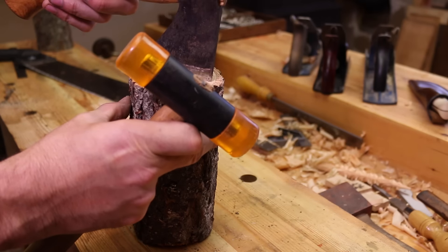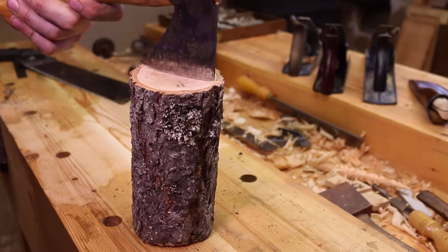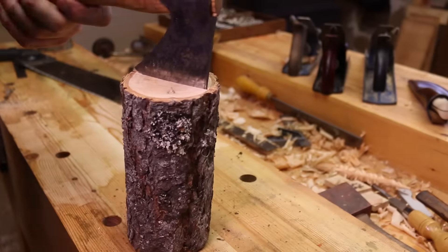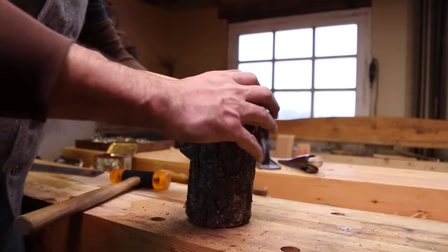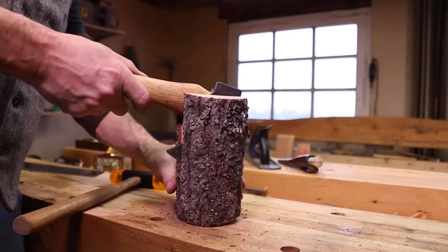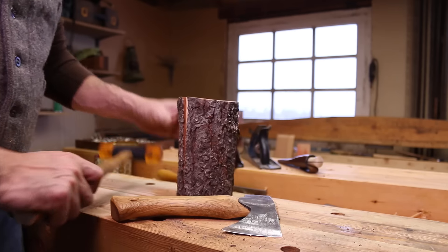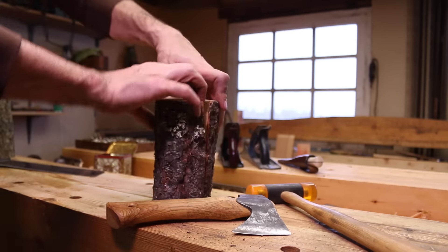I'm not sure how well this is going to work. I'm going to take a small hatchet here. I'll put it in the kerf that I started, and with a soft mallet, see if we can split it cleanly. You never want to hit on your hatchets or axes with anything metal — you can break them. But if you can hit it with a soft hammer, a dead blow hammer, that's ideal.